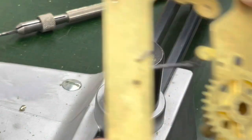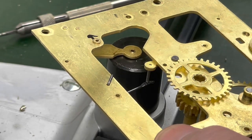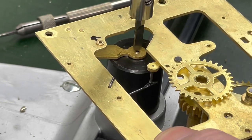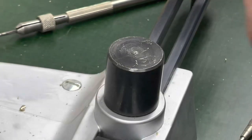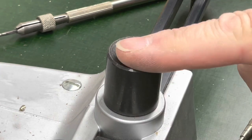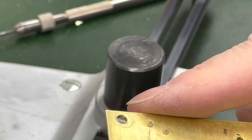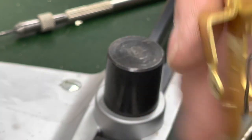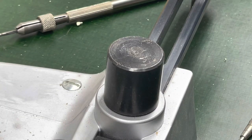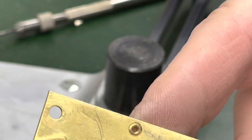broached out the hole on this one, it took the chamfer I put in out, cut it out, because I had to take that much. And I like to make sure I get another one in. And I'll just leave this set up like this, because when I get back from knocking this down, I'll want to do a chamfer on that. I guess I could do this one too. So get this cut down and I'll come back and I'll do this one.